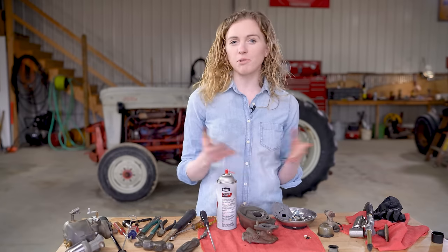You can see that there's both this little brass piece and then there's a little bit of rubber behind it. Looks like there's still a little bit of that rubber gasket behind there. So let me pull that out. Okay, that looks clean. And then I'm just gonna follow with a wire brush like this one. Push that through there so that I can make sure that that portion is very clean. And I'll follow with those same steps down here at the choke.